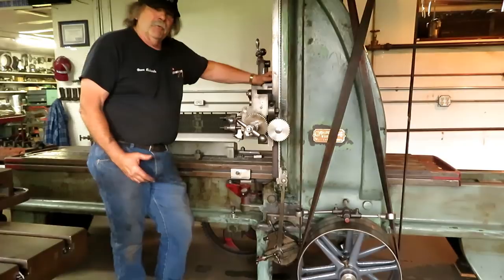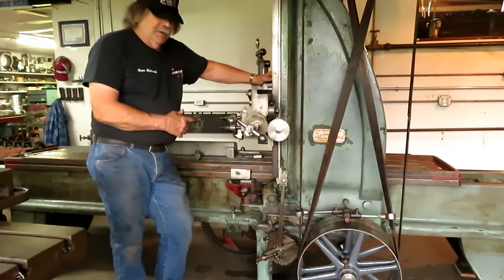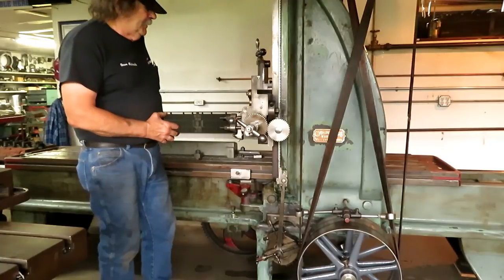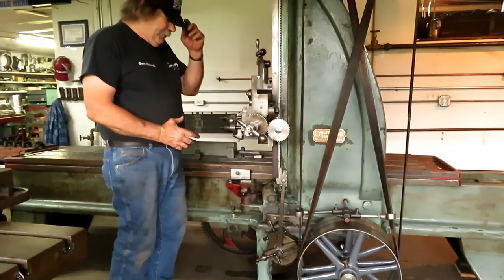I thought I'd just let it run rather than try to talk over all the gear noise. The big gear on the other side is worn pretty bad, and I'm almost sure somebody made a new pinion. So you've got a new gear running against an old gear, and the sound seems to be amplified through the gear itself, and it's really pretty noisy.